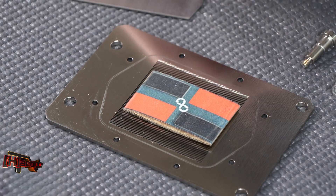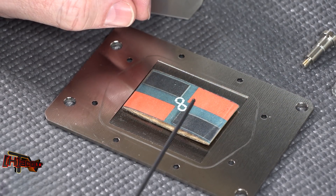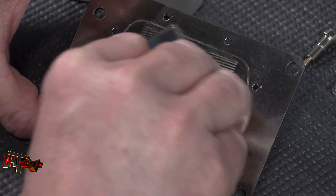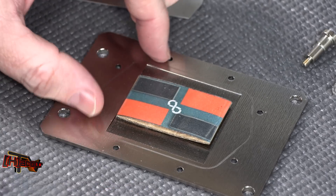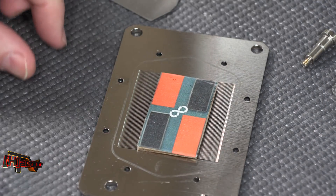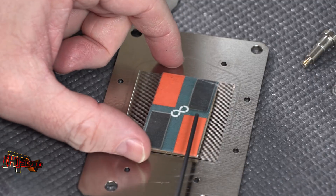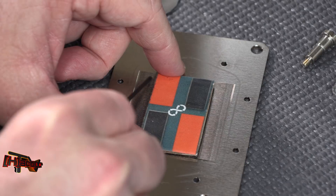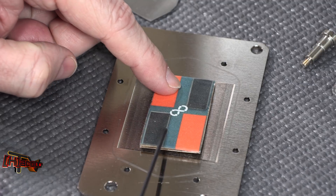Our visual aid showing the active cores in black — look at that, that is a thing of beauty. As we've shown in some other videos, we didn't have enough footprint to cover the cores with some blocks, but we clearly have enough footprint here. The dies should lay out lengthwise like this, so the flow comes right down to the middle and then breaks both ways — meaning the flow path goes across the short side of the dies.